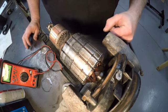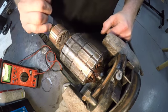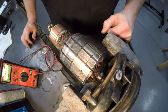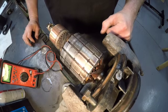That is an oil passage. So our end cap has an oil channel with a wick. That wick lays in there, and there's a little dust cap. You take that off every day and give her one or two drops of oil. And that's what keeps that bushing lubricated, so there is nothing wrong with that bushing.